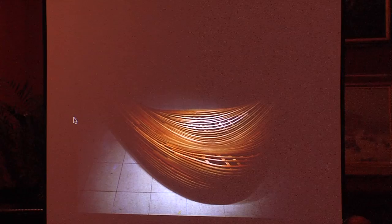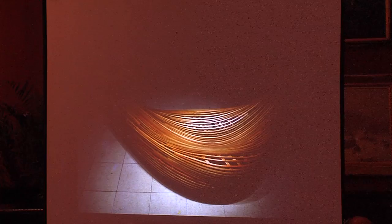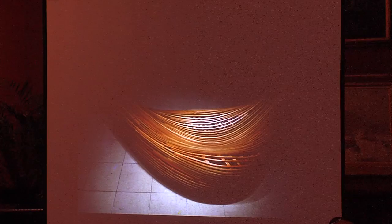The wood I get has to be air dried or solar kiln dried, so it has to be dried for either 6 months or 2 years. Dried very, very slowly, as slowly as possible. So those polymer resins are very healthy and flexible, so that when I heat them up, they don't just break. If I try to steam bend wood from a lumber yard, the resins just snap and the wood snaps.